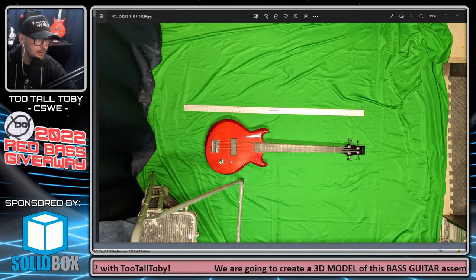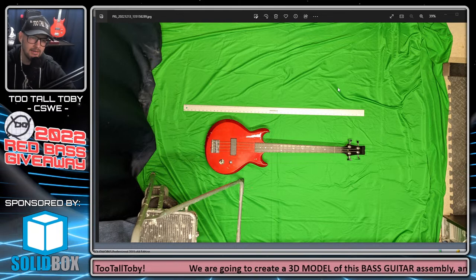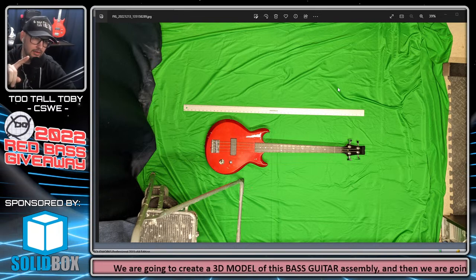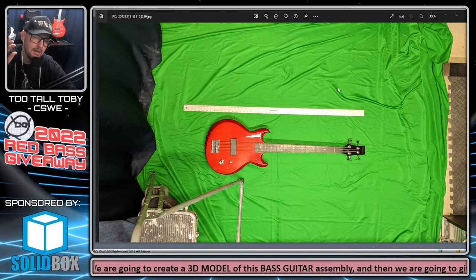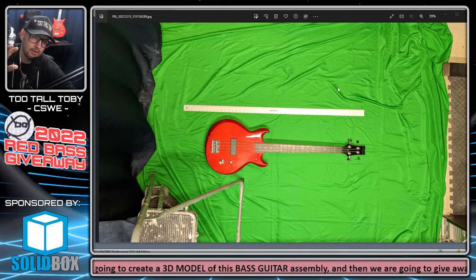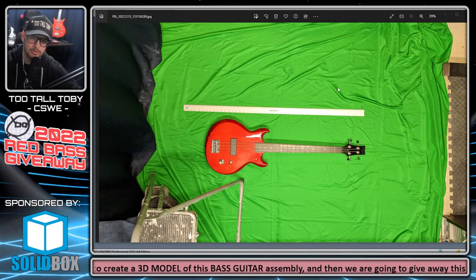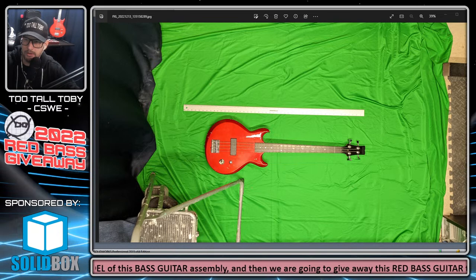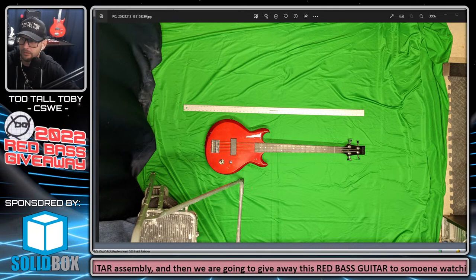I'm going to create a top-down assembly, and I'm going to use that top-down assembly design in collaboration with a single part model. So we're going to have one single part model that's going to drive the entire assembly. This is utilizing a technique that I call the master model layout sketch approach. But in order to get to this point, I had to actually take these photos. And what the process of taking these photos looked like was something like this.